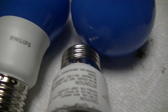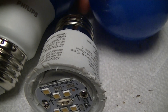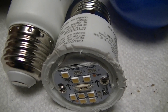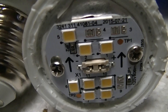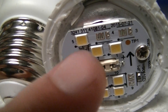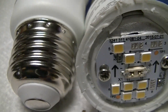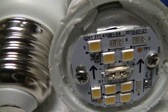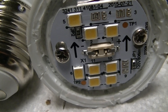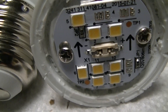Something like this would make a lot more sense if they used a much thinner blue plastic dome and put in proper blue LEDs, because you can get blue LED lamps comparable to this in light output that use only 2 to 3 watts — and those use natively colored LEDs. This is kind of stupid, because a whole lot of the light from this comes from the spectral Gaussian of the cerium-doped yttrium aluminum garnet phosphor, which peaks in the green and yellow with tails in the red and blue. All that light, except for the blue, is blocked by the cover.